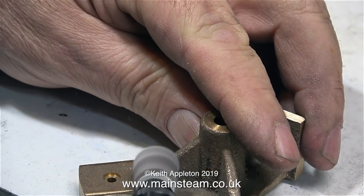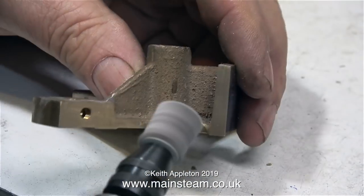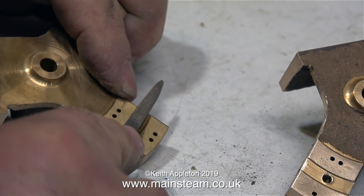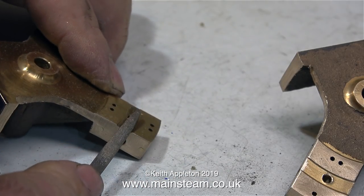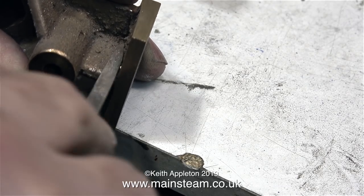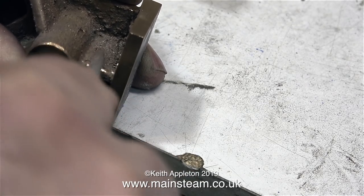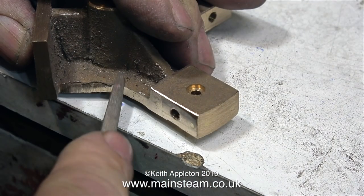What's happening at the moment is the big casting cleanup. The problem with castings is that they are rough castings — as you can see there are lots of lumps and bumps on this piece of metal. And I'm still carefully removing sharp edges with the needle file, mainly the parts in between the steam ports, just so they look okay. I don't want to see a nasty jagged sharp edge at this point. The trouble is though, the needle file is only doing so much — there are certain places where I can't really get it to be effective. The needle file is okay for the edges, but when you go inboard it does get very difficult.